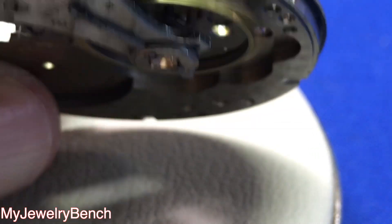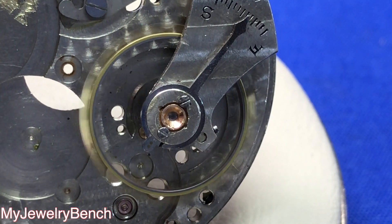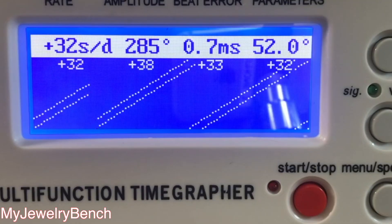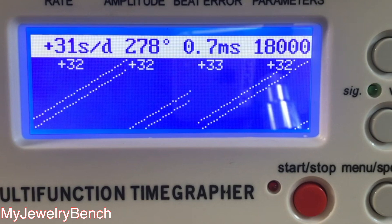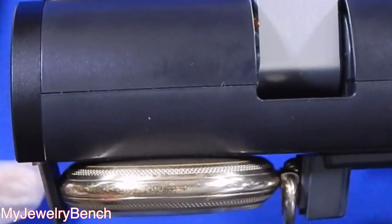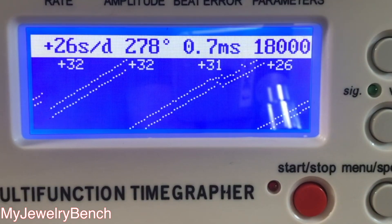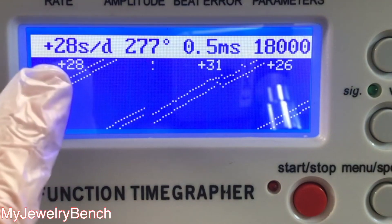In this case the watch ran perfectly upside down and right side up once the jewels were cleaned. The next step is to put the balance assembly back together, clean all the parts, make sure everything is immaculate, and get it all tested and timed. One more good way to test a watch before removing it from the case: put it on the watch timer. If the balance jewels are dirty, run it face up for about five minutes, then face down for five minutes — if the watch indicates it's running faster or slower in one position, then you know a balance jewel is dirty or you have a bad balance staff. So make sure you get yourself a watch timer if you're doing pocket watch repairs as a hobby — it'll save you a lot of time. Thanks for watching!